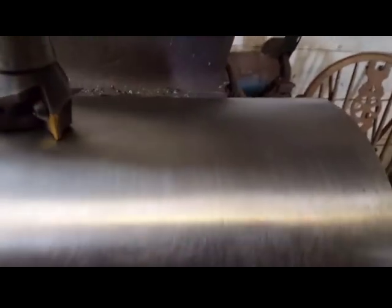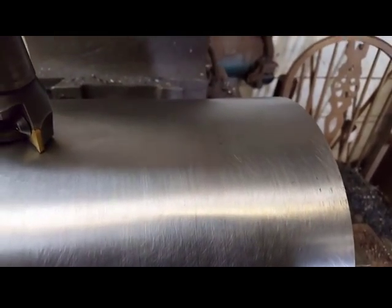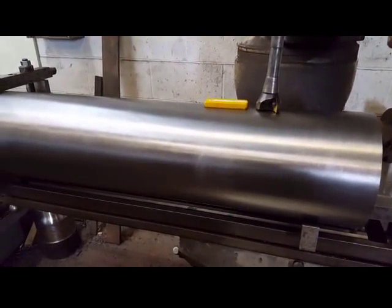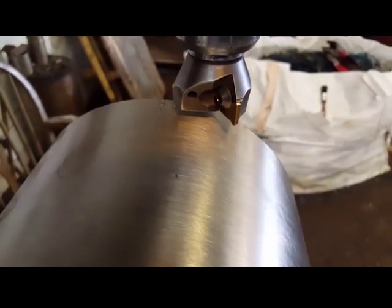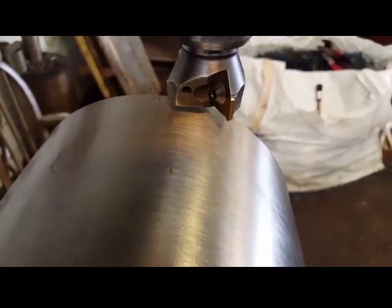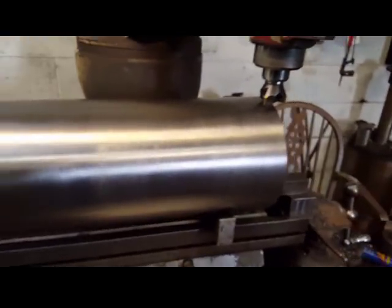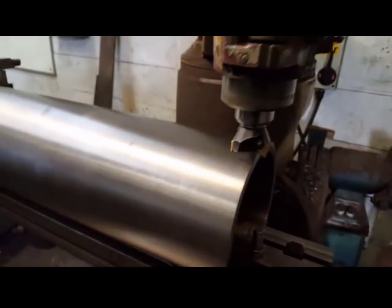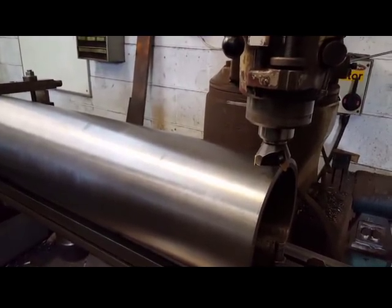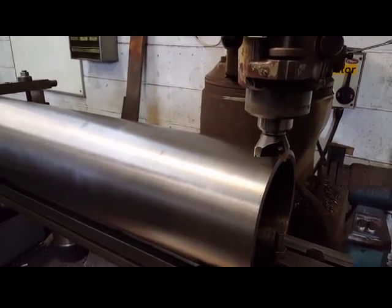What I'll do first is just run the cutter slightly on the top so I know where the top dead centre is. So that's the centre dot marked. Now it's just a case of bog standard milling. Maximum cut I can use on this machine, they're only, I think, 1 horsepower, not even that. So 2.5mm cut, any more and the motor will pull up.